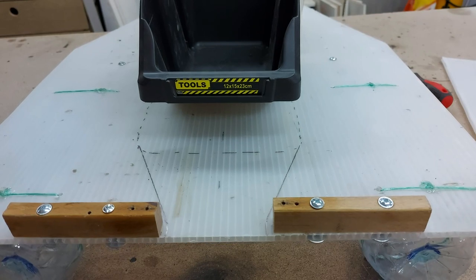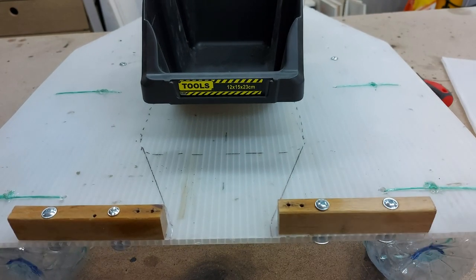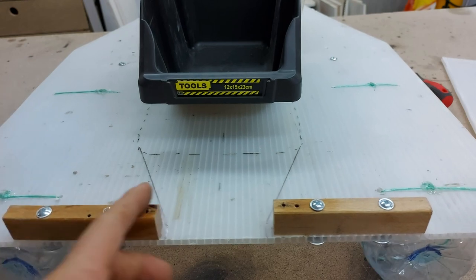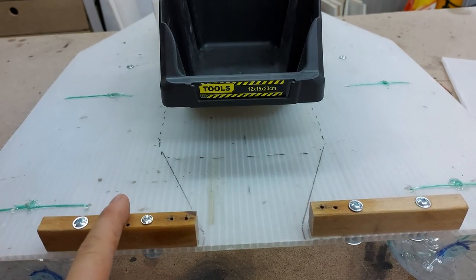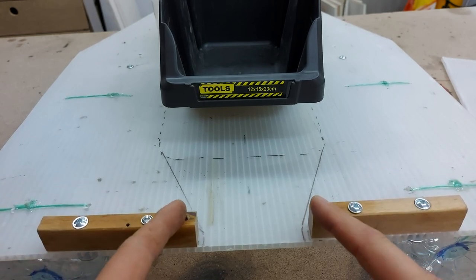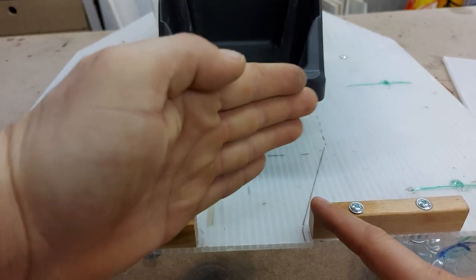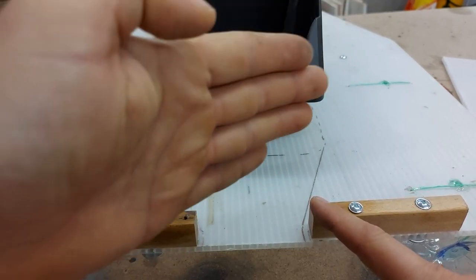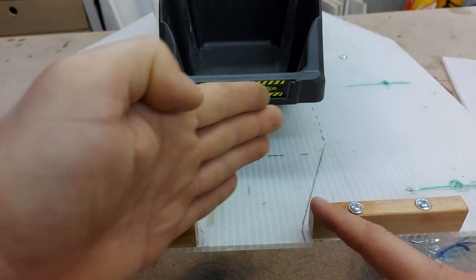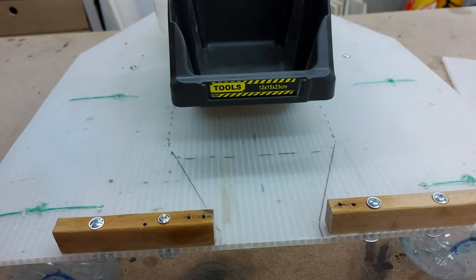So here's where I am at. I've moved the brackets for the rudders all the way to the back. That way they can provide the rotational moment that the boat needs in order to turn properly, and I also bring them a bit closer together than what they were on the front. That way when they are tilted, they will kind of be a stop for the air and push all the air to the side, so the boat hopefully turns now.